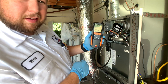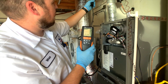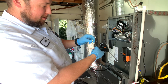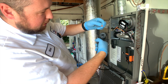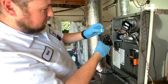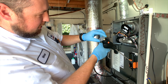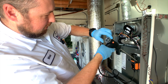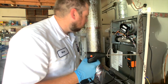Now you see how it says 'plug' — this is where we're going to have to change up the system. We're going to pull this out. On the head here, you're going to take out your particulate filter — it's got a little storage spot in here. This is where your plug's going to be. You're going to actually stick this right in there and plug it up to switch it over to differential pressure mode. Then give a nice twist so it locks in, and now we can actually check our gas pressure.